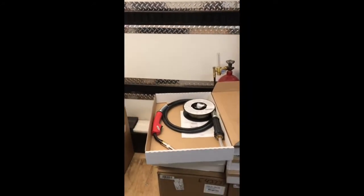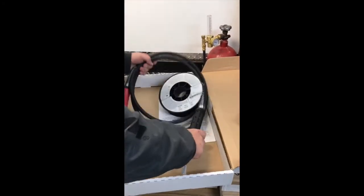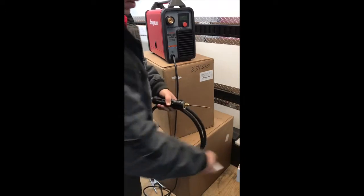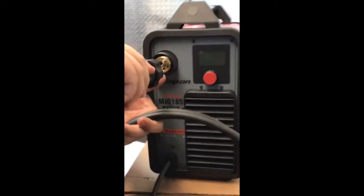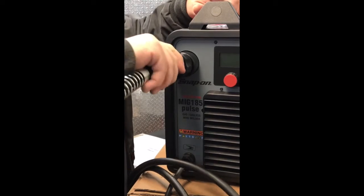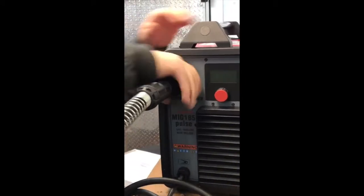Once you've unboxed it, this is the torch that's inside — this is for the aluminum, and it's already marked on there. You'll see you have a protective sleeve right here. All you need to do is take the torch out of the box, remove that little sleeve, and then you'll have a Teflon tube. Inside of here there's a hole, so we're going to line the Teflon tube up inside there and feed it into the machine. Once everything lines up, we'll turn this collar down.